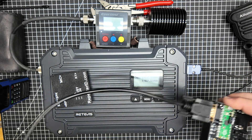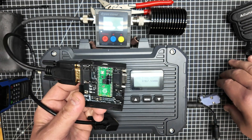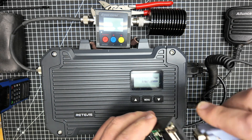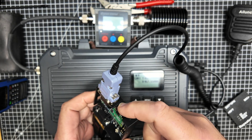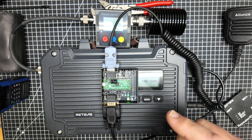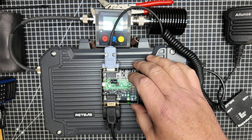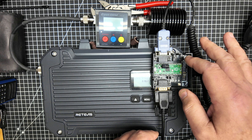Hook it up there — the lid tells us that's the repeater connection. We're going to unhook the microphone from our repeater and hook the Repeater ID up. Then we can either use this microphone on the DB9, or we can use a K1 connector into this set of ports as well. It works the same way. I have a radio already tuned to the channel that this is on. If we press this button, it will automatically do the repeater announce. This is the default message that comes on the unit — let's get a listen.